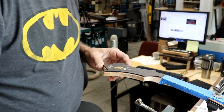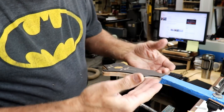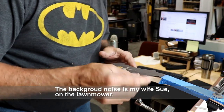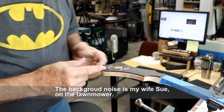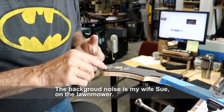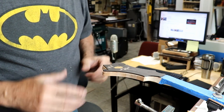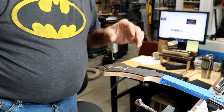I'm going to quit while I'm ahead. You have to be careful going this way because this slopes under and your thing will let you plunge too deep right in this area. I got close, I'll be honest, but I think I'm okay. Now I've got to do a lot of hand routing because the edge protrudes out further, so this doesn't route deep enough on these ends. I also have to route around the inside of this hole. There's a lot of hand work yet, and I'll do most of that off camera.